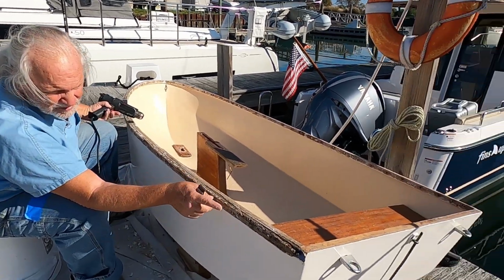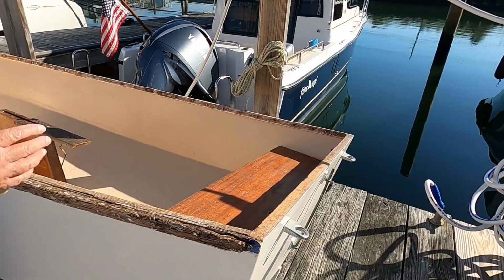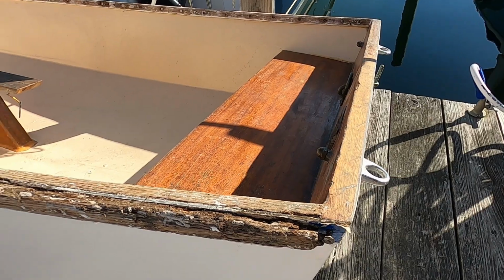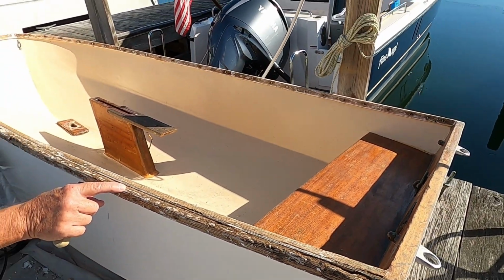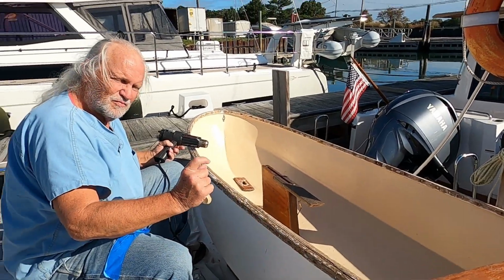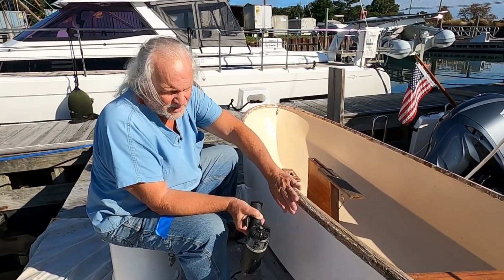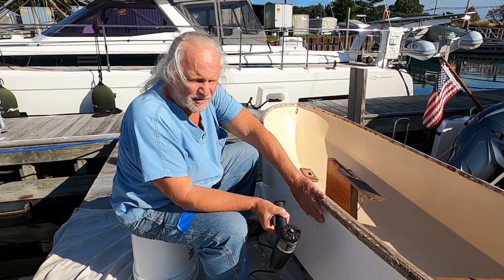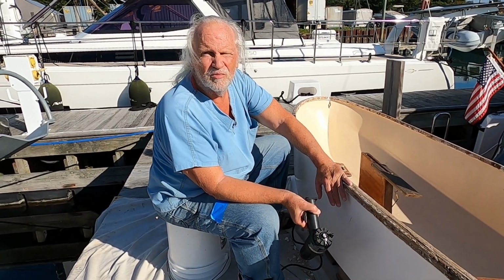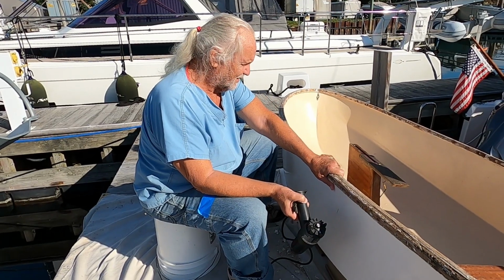But what I'm going to do is make a mold, and I'm going to cast this in epoxy with thickener just as a stopgap, and then we're going to cover this with a bumper material. It's actually a fabric that has a foam in it, and we'll run it, you screw it, and it's very nice. It keeps the edge of the boat from damaging things like the other boat. And that should be okay. Again, we can use that for years. It's just embarrassing. Cover up the worst of it.